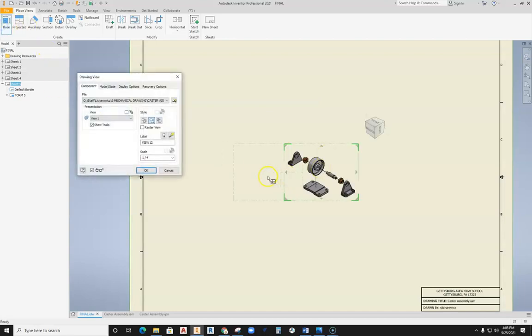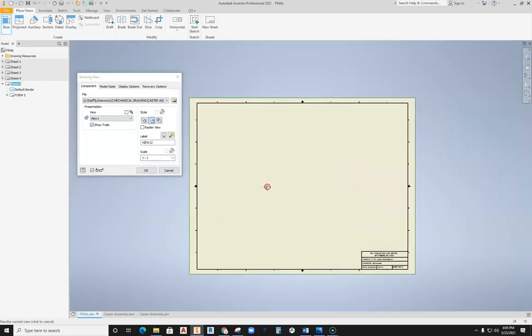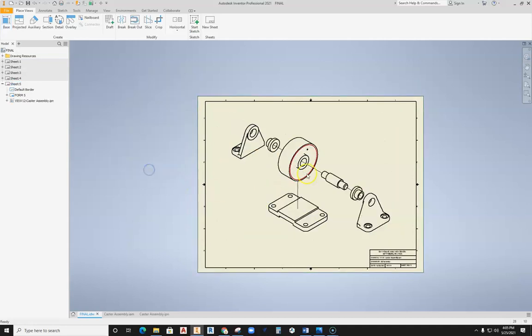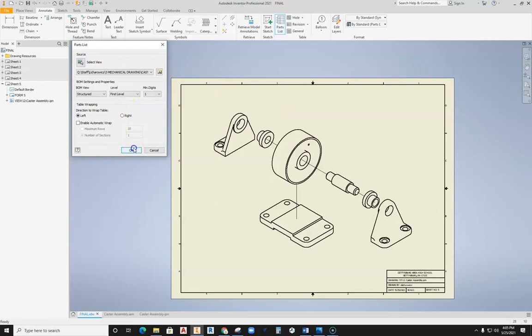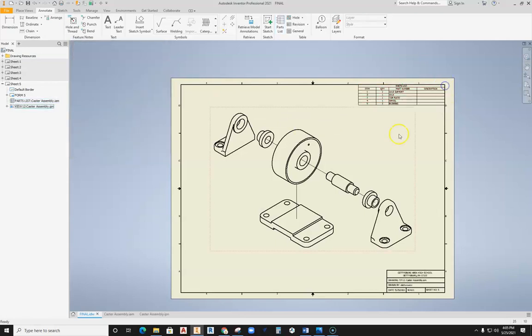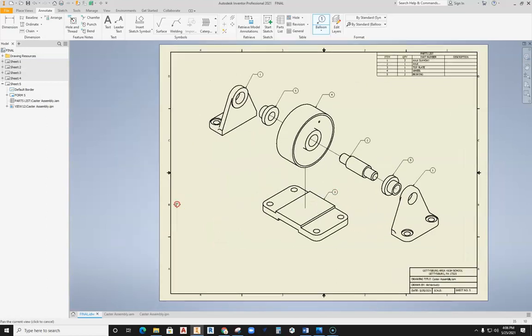Go ahead and hit Base, and we can start to see the caster popping up here. We can take this thing to one-to-one scale — yes, we can fit it one-to-one. Set this up on sheet and hit OK. With that set into position, I can grab the Annotation tab and immediately grab my Parts List. There's my parts list for the object. Then I can start ballooning my parts and move through this object so that all the balloons come off at a nice clean angle. With setting all this up, you can see how quick and easy this really can be to create an exploded view drawing. Hopefully this helps get you through the caster assembly assignment.